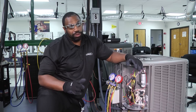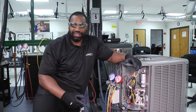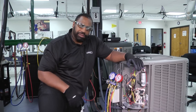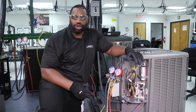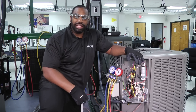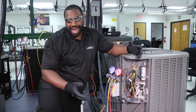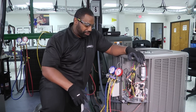The biggest thing and the number one thing is that we demonstrate and we operate with a level of safety. You always want to make sure you have on some type of eye protection and something to protect your hands. The temperature of that refrigerant, especially coming outside of the liquid line, can get really cold really fast, and it's very easy to experience frostbite in a very short amount of time. You always want to be preventative, because an accident wouldn't be an accident if we planned it, right? So make sure that you're safe when you're working on refrigerant.